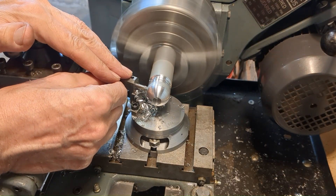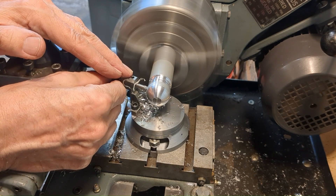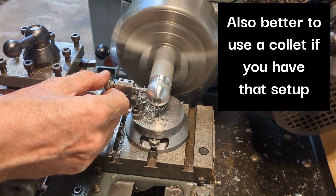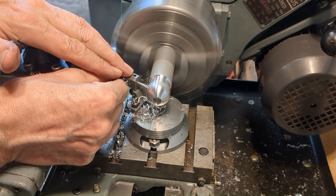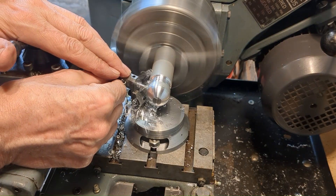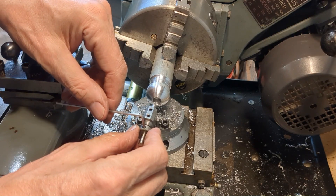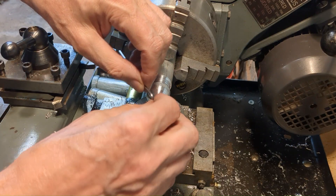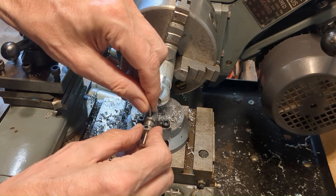The thing you have to watch out for is when you get up close to the chuck — that might be a reason for making a handle so that you can keep your hand away from the chuck. So this is where the collar comes in: you can bring the collar up, lock it, and then control the gap or the amount by which you advance the tool.